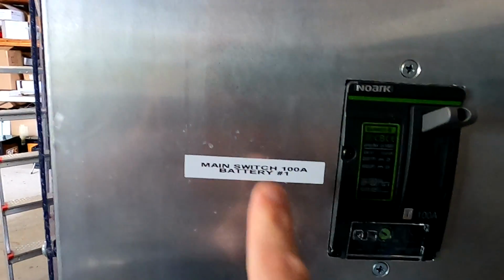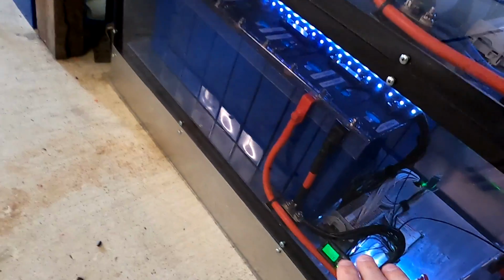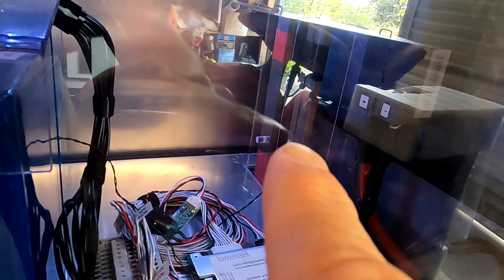And these circuit breakers are also main switches, so I can just turn off 1 or 2 of these breakers here and the whole system will now only run from the bottom shelf battery, because these 2 are completely isolated now. Positive, negative, terminated. From the vertical busbar system we can see there in the back. See, this busbar system goes all the way through until the bottom of the shelf.